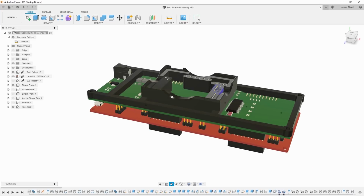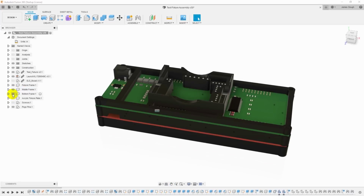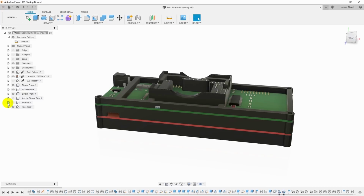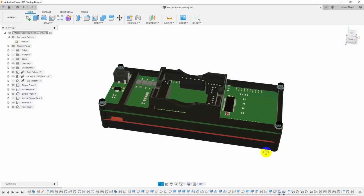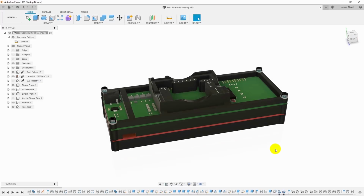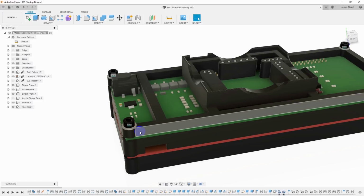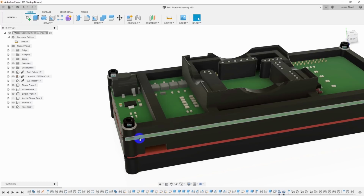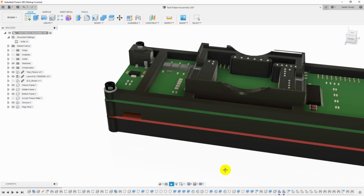And then, just to wrap the whole package up, I designed a frame to fit between the boards and a frame to sit on the bottom, and then the whole thing will be held together with screws. Now, of course, in order for this to work, everything has to be the right size. Specifically, these screw holes have to line up between the 3D printed parts that I'm making and the PC board here that I'm having made at a fab and the PC board that came from TI in this launch pad.